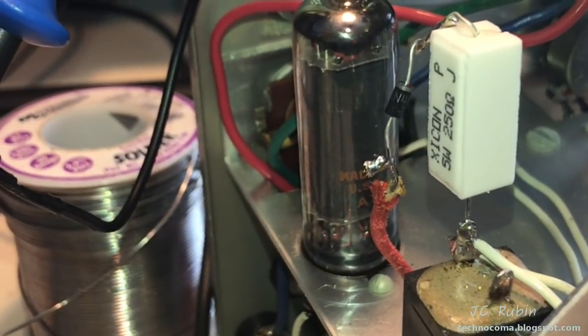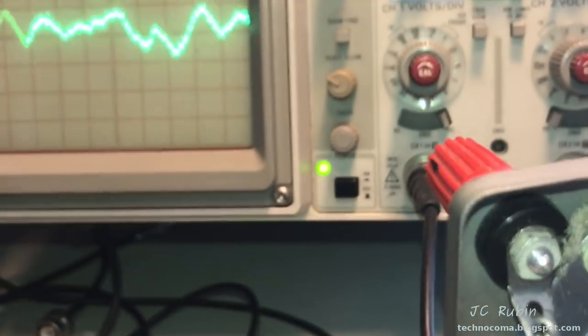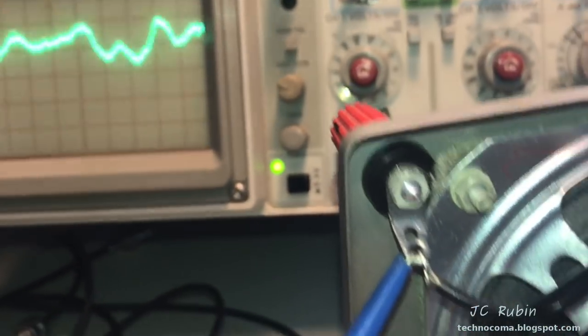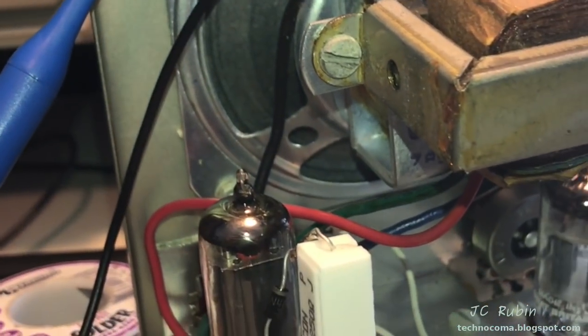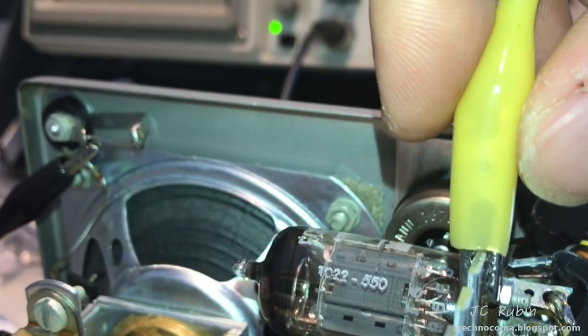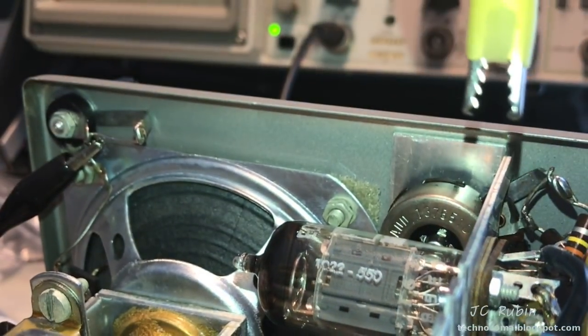I've cleaned up that rectifier installation, and now that I've got the noise down to a more manageable level, I want to short out that coupling capacitor and see if this clears up. That'll split the circuit into two pieces and tell me where the rest of the hum is coming from. So the effect of grounding the coupling cap can definitely be heard. Here we go. Off.